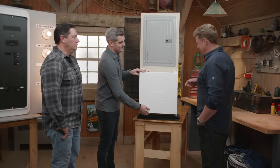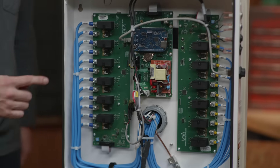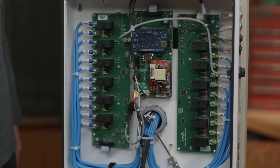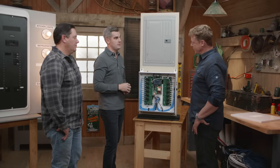And so this is the new. Look at that. So this is called a smart panel, and it's providing us with load management. If you look at it, you have six relays here, six relays here. This controls up to 12 circuits. The circuits from here are fed through this and then to the load — so not additional. These have the ability to measure what you're actually using at each load. So you can see on your app, on the phone, exactly how much power is flowing to every one of those loads.